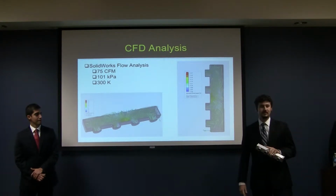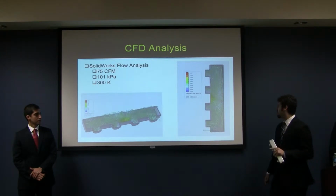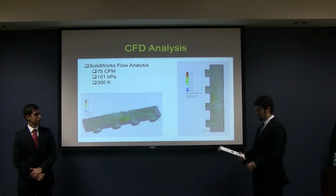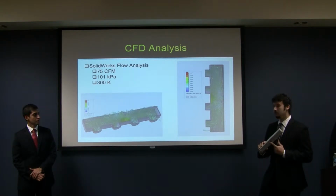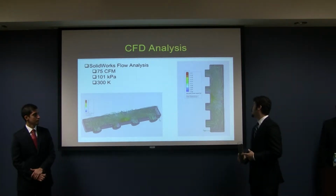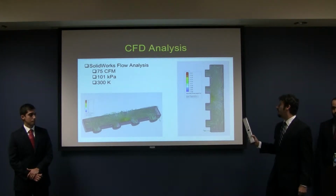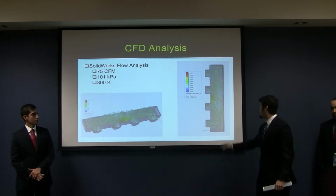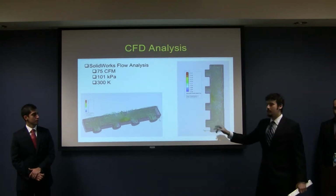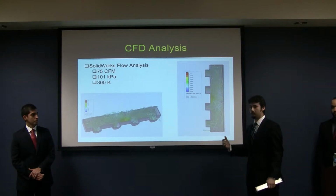Although you do see this type of design commonly used in production engines, if you were to run the simulation without the 20mm restrictor right here in place, the restrictor is integral to this design, by the way, this is a 20mm opening, you would see clear, relatively laminar flow profiles inside this chamber. Because you have this restrictor in place, your intake velocity right here, it's not on here, but on an unrestricted engine, it would be something like, I think, 30 meters per second. On this engine, it's 120.